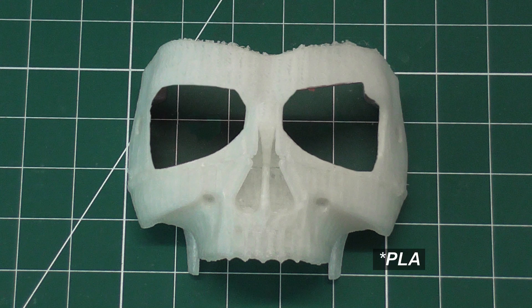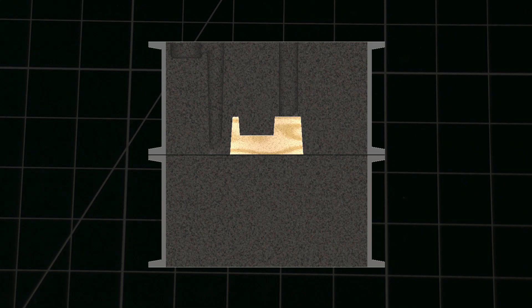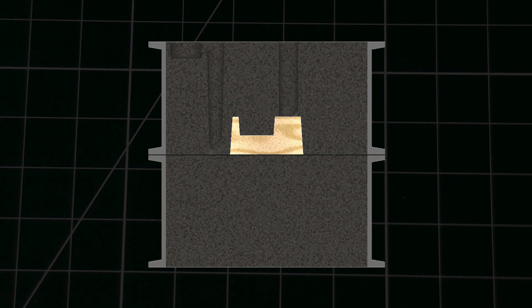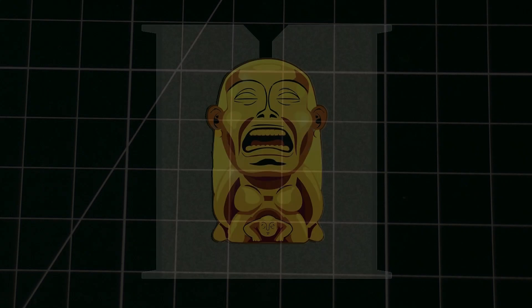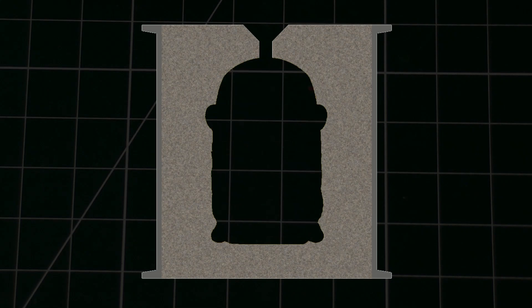What if I could turn this into this? The problem with sand casting is that the pattern must be removed from the mould before the metal can be poured in. This means that the pattern must be shaped so it can be withdrawn from the sand, limiting it to simple shapes only. There is another method called investment casting, where the pattern is removed by melting or burning it out. The mould does not need to be opened and practically any shape can be cast.